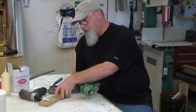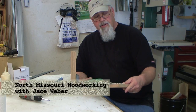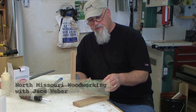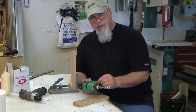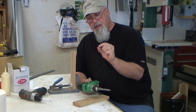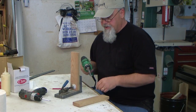There's some arguments about where that needs to be. I think maybe Kreg says that you need to blow all the way through it, which is going to be making a little dimple in the bottom of your jig. I like to have mine set to where they stop just short of going all the way through the wood - so maybe a 32nd or so, or maybe a fat 8th where the bit doesn't penetrate all the way through the wood.